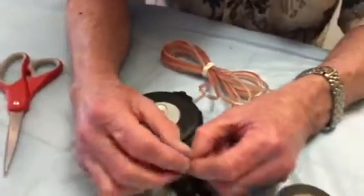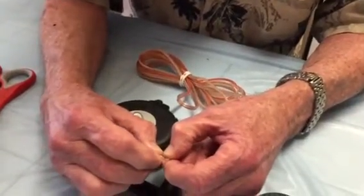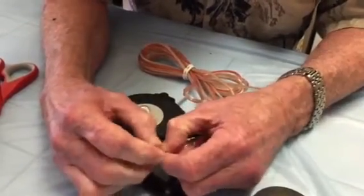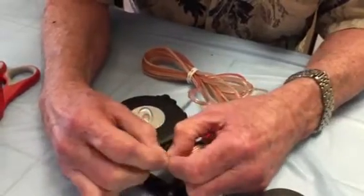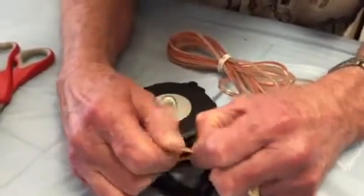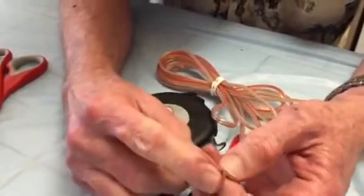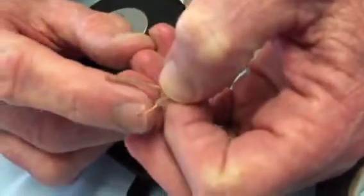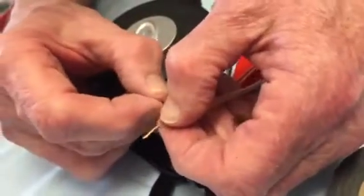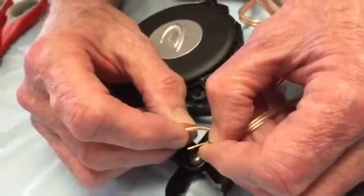When you're ready to put it into the amplifier, I pre-cut these little guys — this you've got to take a little time with. You also need to be sure that your red wire is going into the back of the amp in the red slot. The importance of this is it's a short wire, it's well wrapped, and you don't want them where they can touch each other. So we only put a small amount in, so once they're in the back of the amplifier they cannot touch each other.